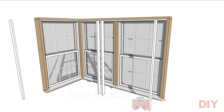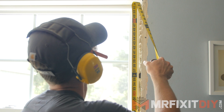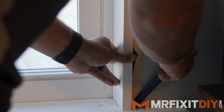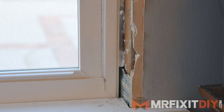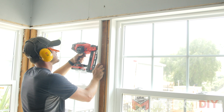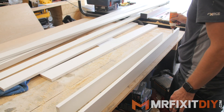From there, we can work on the side stops — these are the vertical pieces that dress up over the framing. In this case, there are a bunch of them, but on a single window you'll just have the left and the right. Again, these should be ripped to the thickness between the edge of the window and the face of the surrounding drywall. Plumb them with your level and attach them with brad nails. In this case, I'm gonna need a couple extra side stops in the corner where it wraps around, so I'll measure these and build a piece to go in the corner.